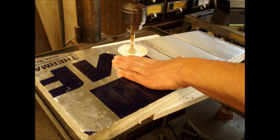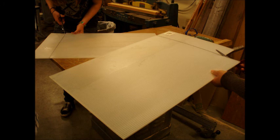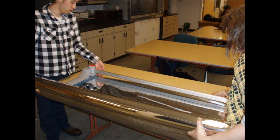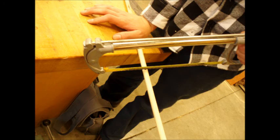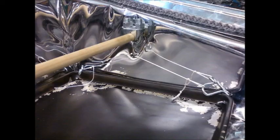There must also be a hole big enough for the dowel to fit through. Next, we will assemble the panel. Cut the corrugated plastic to size and cut the Mylar large enough to cover the top of each panel. Smooth silicone glue along the edges of the plastic and put the Mylar in place. Now, the swing is assembled by first cutting the wooden dowel, then working one end into the flange. After the flange is on one end, slide on both pieces of wrapped R-Max, then put the flange on the other end of the dowel. Check to make sure the dowel is of the right size, and if so, drill holes for the bolts and bolt it in place.